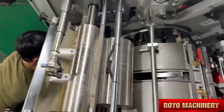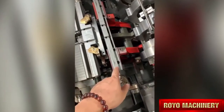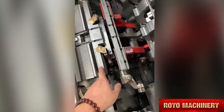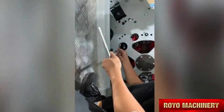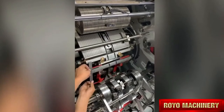That side. The back bottom is 80 mm. So from here to this line should be 70 mm, okay? Here to here is 70 when the setting. This is the screw, okay, when the setting to adjust the space. We need a setting to 70.